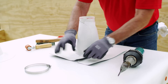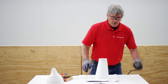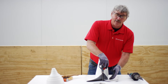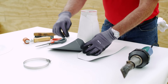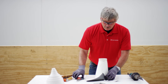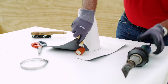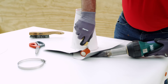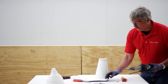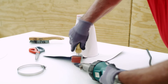Now here, this is the first area I'm going to weld. I'm going to give it a little tack so it doesn't move on me. You want to kind of get this out of your way. If I'm on a roof with insulation, I could use my scissors and poke that down and hold it on my way — some guys think, well now you've got a hole there, but if I've got a hole there it's going to be covered up. So weld this little piece down here first; otherwise you're welding about 90 mil trying to weld everything down at one time.